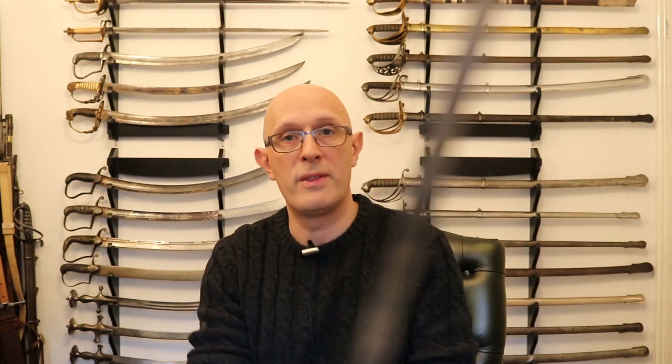What I really want to emphasize to modern makers of blades is that a significant proportion of European swords do have distal taper — they are thicker at the base and gradually get thinner towards the point. The general rule is that distal taper is desirable for the handling characteristics and performance of many sword types, and is present in a huge number of original, antique, and surviving sword blades — from Roman gladius and spatha, through medieval, into the Renaissance. Rapiers, side swords, broadswords, and backswords usually have distal taper. When we find none or minimal distal taper, it typically fulfills certain criteria related to a broad cutting blade.